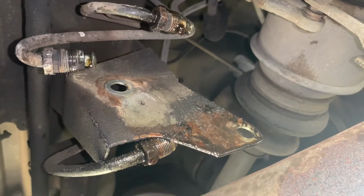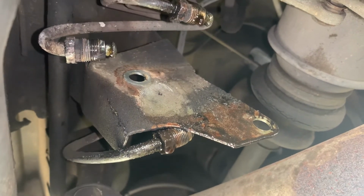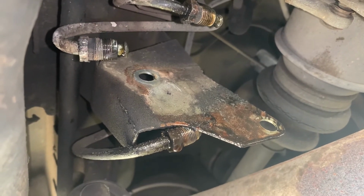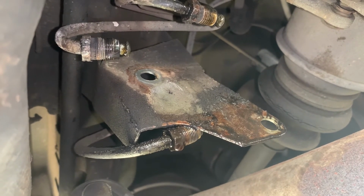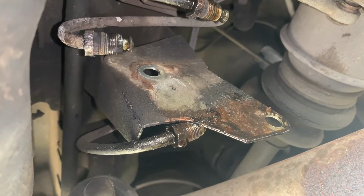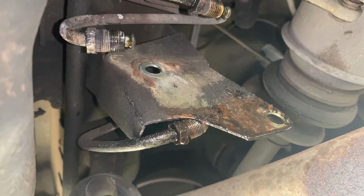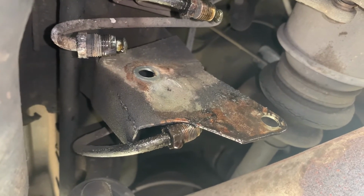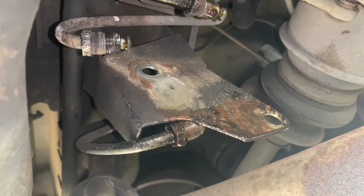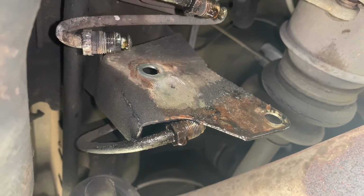Valve is rebuilt and we're ready to put it back on. I'm not going to video putting it back on, but I'll set up a time lapse for it. What we're going to do is just start the bolts and leave them loose until we get all of the hydraulic lines started. Of course, we're not going to torque any of them down until it's bolted up tight, but we want to be able to wiggle it around, and I may even not bolt it in at all till they're started.